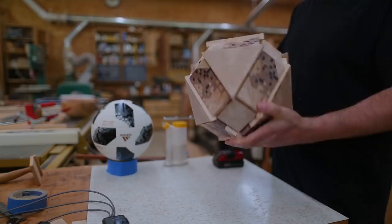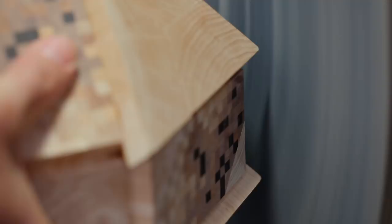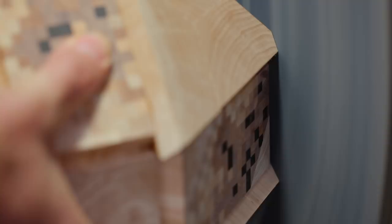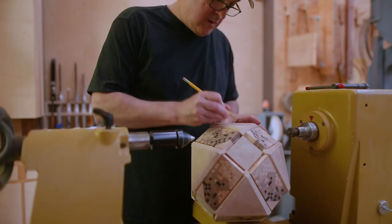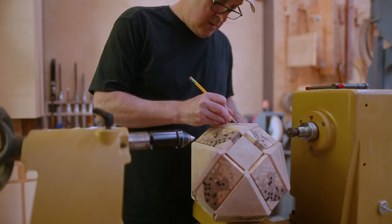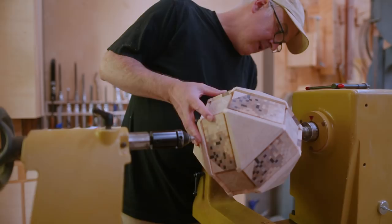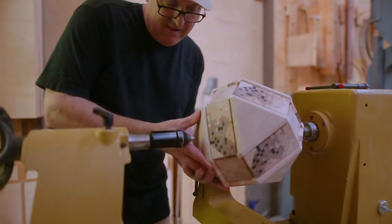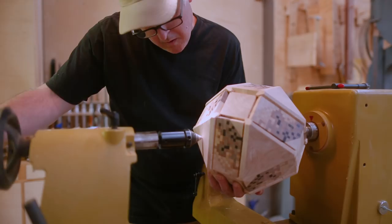I let this sit overnight so it would be nice and dry and the glue would be set really well. It was really nice just in itself. I decided before I put it on the lathe I should sand off all of the pointy bits so those won't break off quite as badly on the lathe. In putting it on the lathe, I had always figured I would use the squares as the place to mount it, but I didn't really have a center marked on those squares. I did have a center on the triangles, so I ended up mounting it from triangle to triangle. That worked really well for mounting, and it meant the edges were diagonal to the spin.